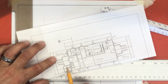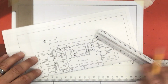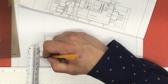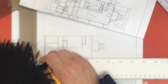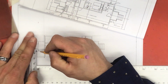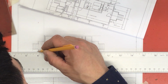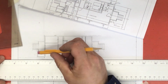All right, now we should add these little doors. You're gonna notice the door butts right to the step. All right, when you measure it, I believe it's 5 feet out, it is. And it goes just before the edge of the house. So it says 5 feet by 4'6". So off the edge of the house, mark you 5 feet. And then coming down from that railing, mark you 4'6". Very, very close to the edge of the house. Comes right next to the handrail. Bring your handrail out. Find the center of 4'6": 2'3". Put your little middle line right down the center. Okay? And then do that same little border that you had done for the steps for the set of basement doors.